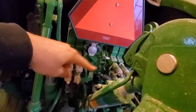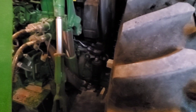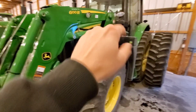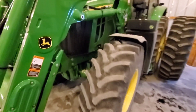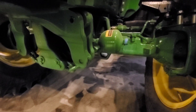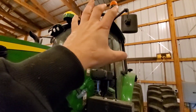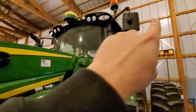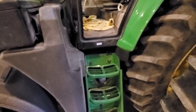This is a very loaded tractor. It has the electronic SCV stack — times four — as well as the heavy duty PTO housing, heavy duty internal brakes, and the cab suspension option. The tractor will produce up to 144 engine horsepower and up to 118 PTO horsepower. It is also equipped with the TLS front axle, which stands for Triple Link Suspension. Moving up the tractor, it has the LED lighting option, which is the best lighting option available, as well as rear view mirrors and a StarFire 6000 receiver.